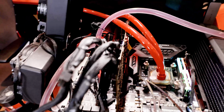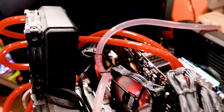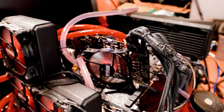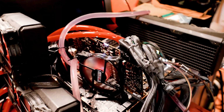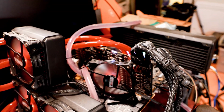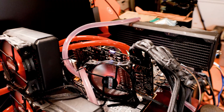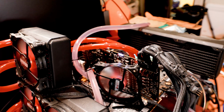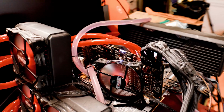So if you do have a broken KINGPIN, you might want to check that little linear voltage regulator out. Make sure that it's outputting around 3.25 volts, 3.23, 3.25 volts.